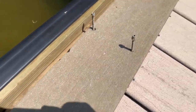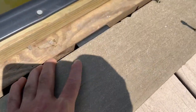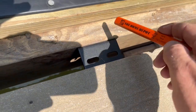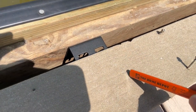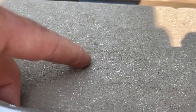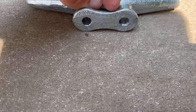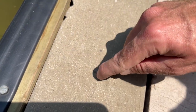Now I'm putting this board back close to in place, lined up on the right and left perfectly. I come back over here, pull it off a little bit until I find my bracket. Now I can see where my holes are — it's about two and three quarters away from that wall to this hole, so I'm going to mark two and three quarters from this end. You have some wiggle room to work with left and right, so the main thing is measuring from that end and drilling out your holes.